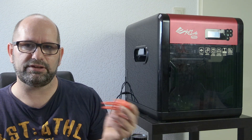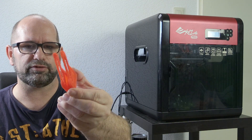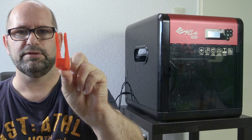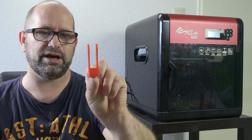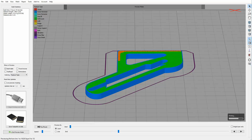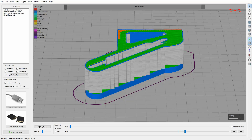When you print this design from Thingiverse — the link is in the description below — you need to print two of those holders for your fan. I also linked to the fan on eBay where you can buy them. It has to be a five-volt fan — make sure you buy the five-volt fan. The file is oriented flat, but I printed it on its side because that way the print will be way better. You need to use some support inside, but the prints come out much better. So print it on its side with support, and also print the backplate because you need it to mount everything on.